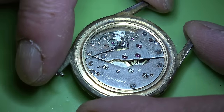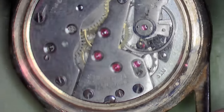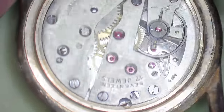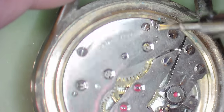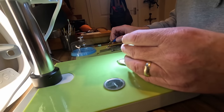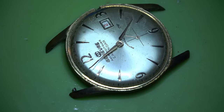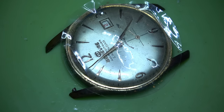It is running but it struggles. It's actually a pin pallet — I wasn't expecting that. It's 17 jewels and it's got a pin pallet. Normally you might get five jewels at most, seven, and as little as one or two with a pin pallet. The idea is to keep the cost down, but the fact that this has 17 — why they didn't go the extra with the other two on the pallet fork, I don't know. If anyone has any idea, please leave a comment. I suspect it could be something to do with import taxes.